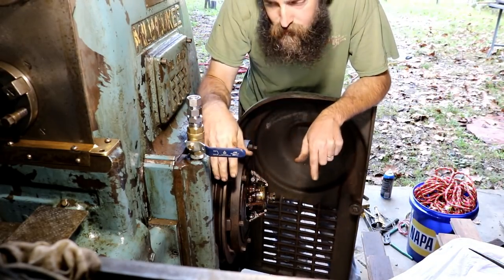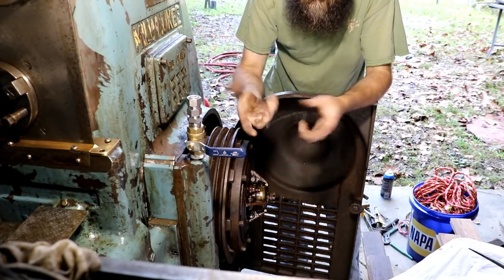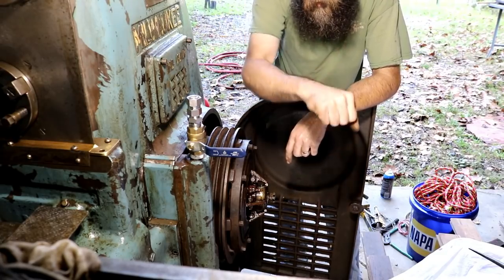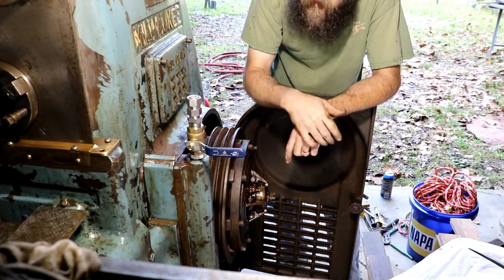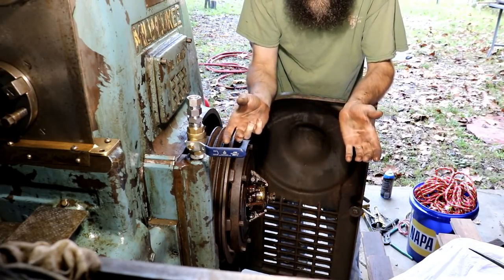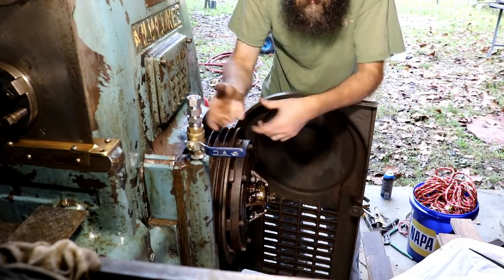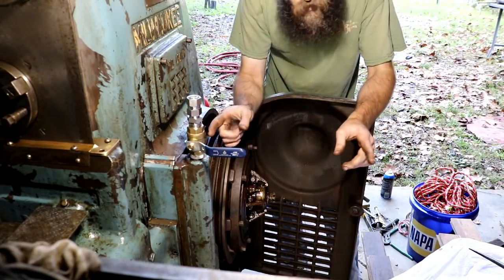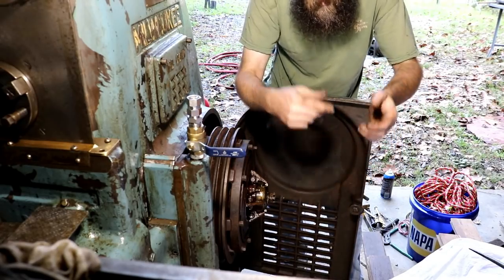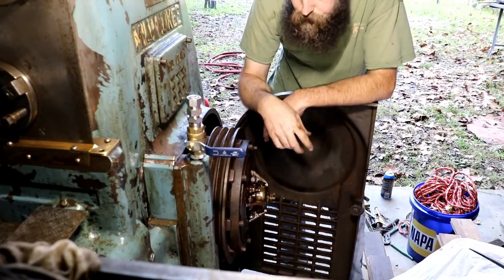Well, the problem is that I've looked in the parts breakdown, and it's a rack and pinion system that runs this. There is a gear on the hand operated lever up there that runs on a rack that moves side to side. Well, that shaft, it's a simple shaft. It has some gear teeth on it, of course. It steps down and then pins onto a fork that moves in and out.